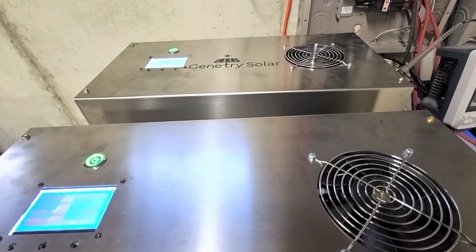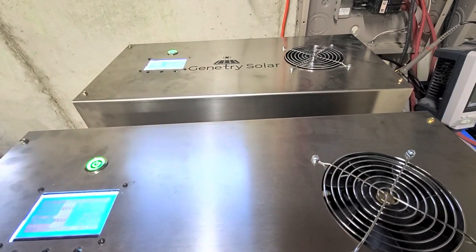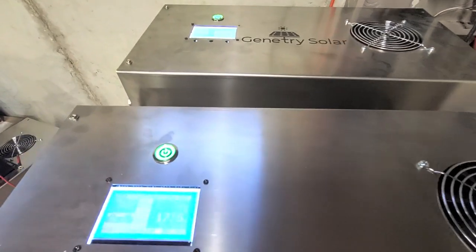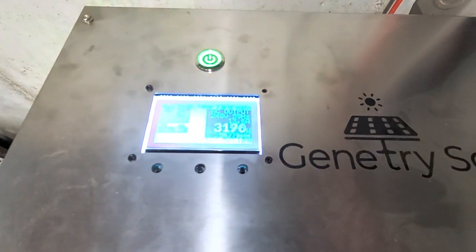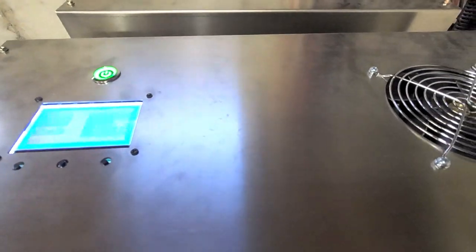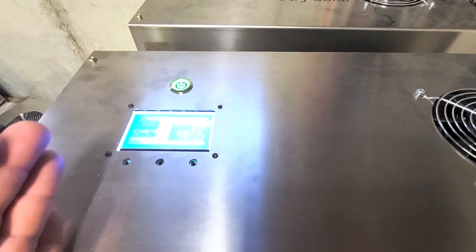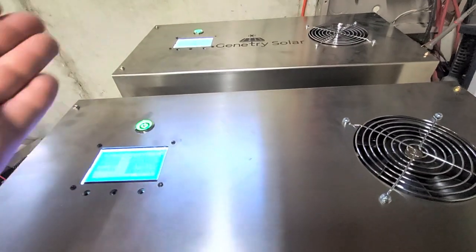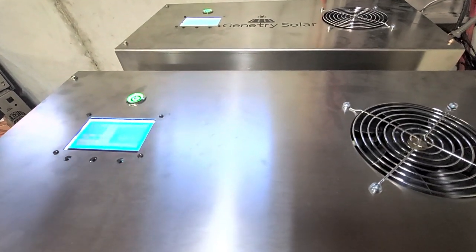What we're doing is trying to tweak that number to determine if a surge load is well within the capabilities of the inverter itself. The well pump just kicked on again, and these numbers are not dead on. We are still tweaking. The slave inverter is doing less work than the master inverter right now — that's all in software. SID is taking the information I'm giving him, tweaking it, fine-tuning it, getting it where it needs to be.